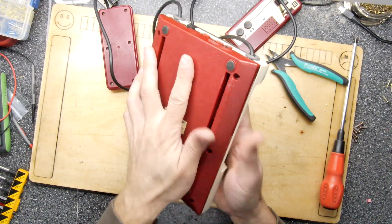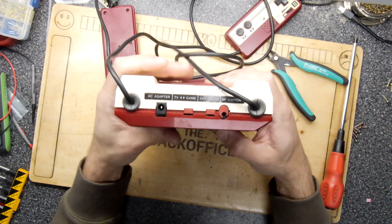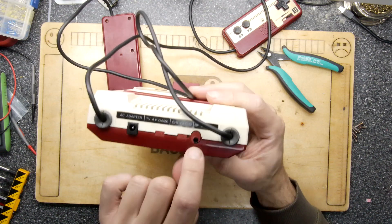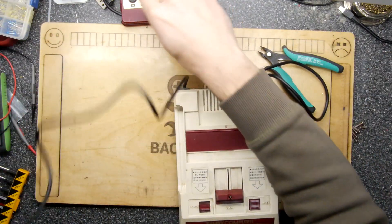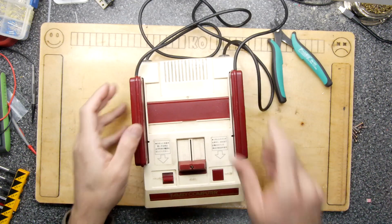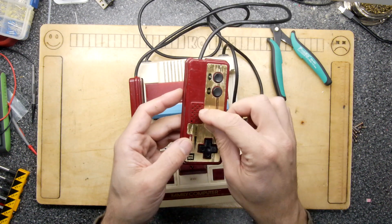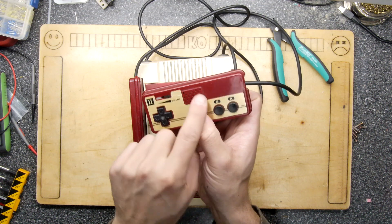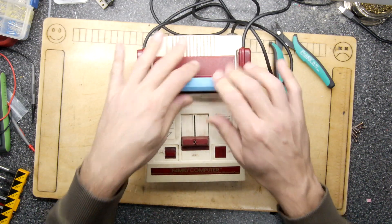That's the perfect finishing touch. Make sure there are no cables caught, then screw it shut — it'll seal up the seams nicely and you get a lovely cover on the back. That one is done. One tip before setting it aside: make sure the volume on the right controller is turned down. A lot of people on the Discord complain about noise — that's because the right controller has a microphone, and the volume knob controls the microphone recording level, not output volume.